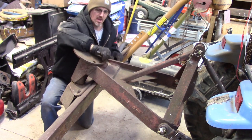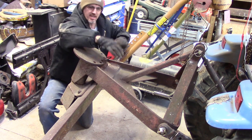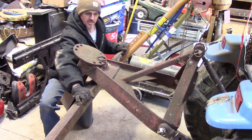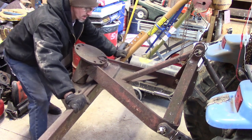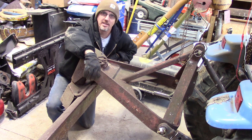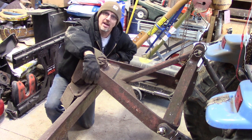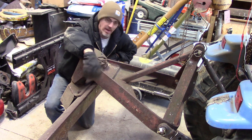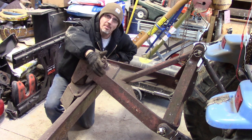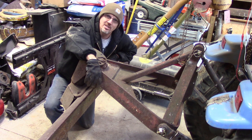There it is, mounted back on the tractor. A little snug, but it does come out and go back in. It's a little snugger on the other holes — I think once I use it a little bit and it bounces back and forth, it'll wear in some. It's quite a bit better; it only has about a half an inch of play in it, which I imagine brand new blades have at least that much play. So if you have any questions or comments on our rear blade repair — it's not perfect by any means, but we used what we had and it made the blade more functional — put those questions and comments down below. We'd appreciate a thumbs up and always please subscribe to our channel, and if you shop at Amazon, be sure to check our Amazon affiliate link. It doesn't cost you a cent more, but it gives the channel back a few cents. Thanks for watching, and you have a wonderful day.